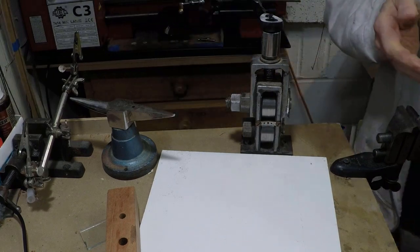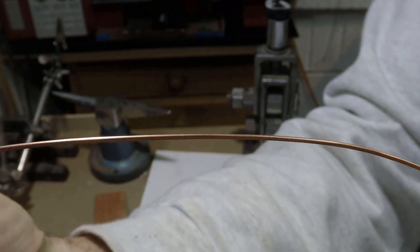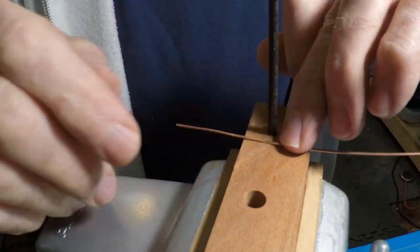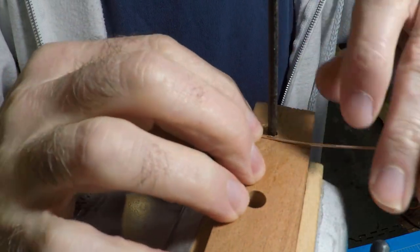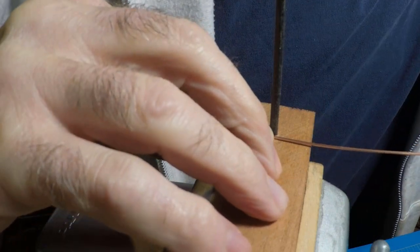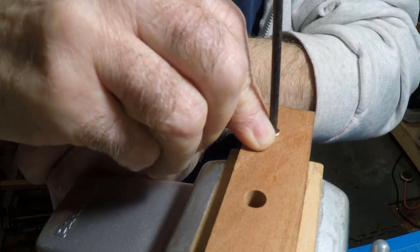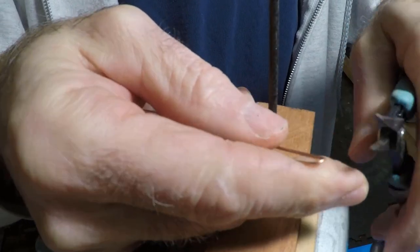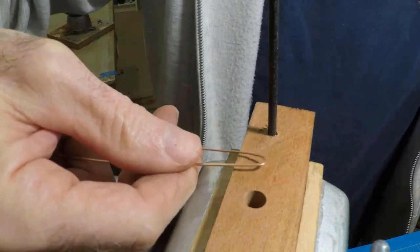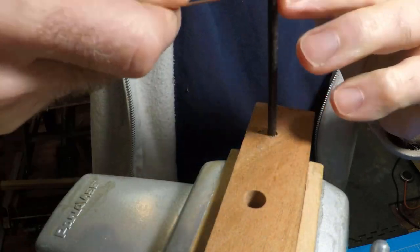Once the stock looks the way I want it, I use a drill bit as a mandrel again - this is again the actual size of the mast at the tabernacle. I don't find it necessary to make it any larger; the forming process will actually make the mast strap a little larger. When bending it around the mandrel, the stock will want to curl up on the inside of the radius. This is not something you really want. You'll always have some small amount, but just try and keep it to a minimum. In this example, you can see I do have a little bit of a curl, and this little bit is easily eliminated with a few taps from the hammer.